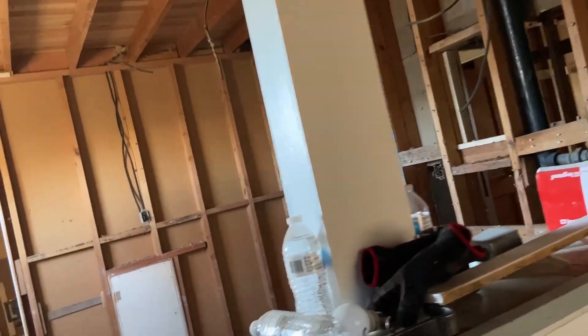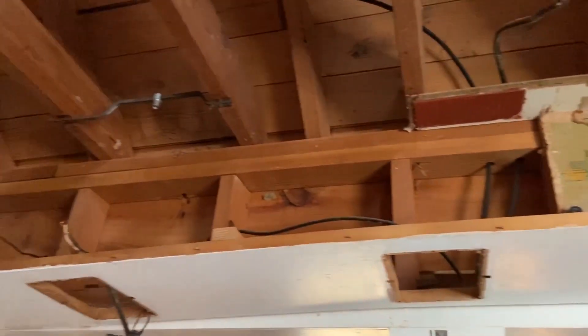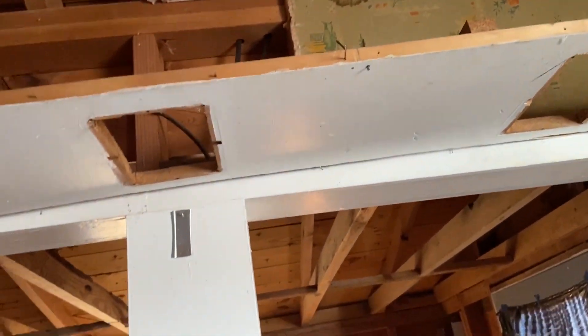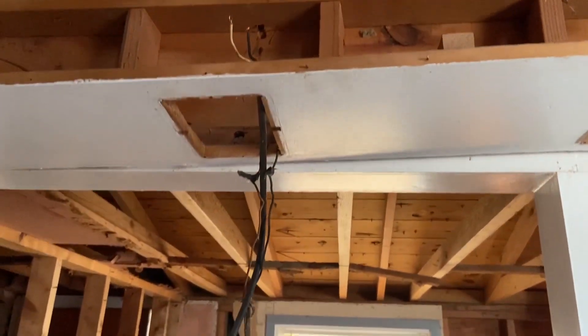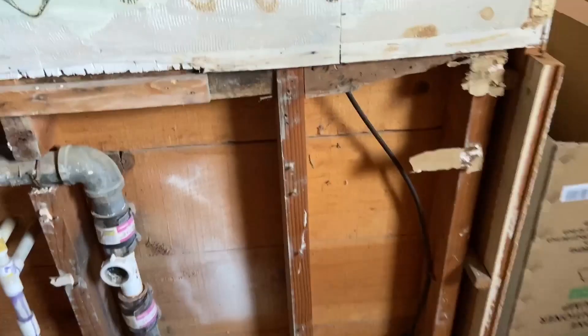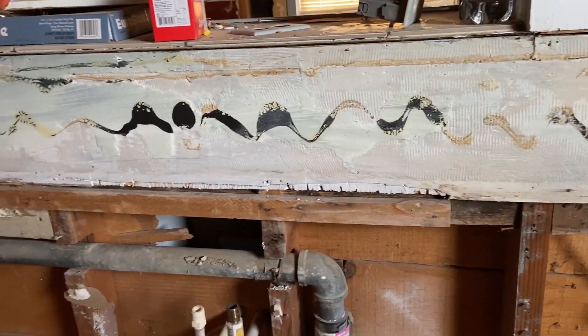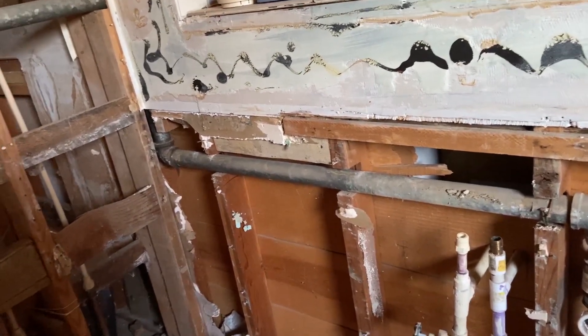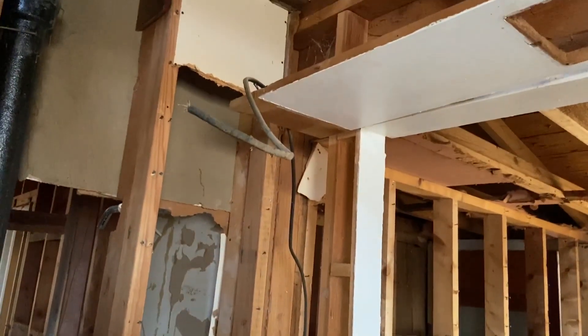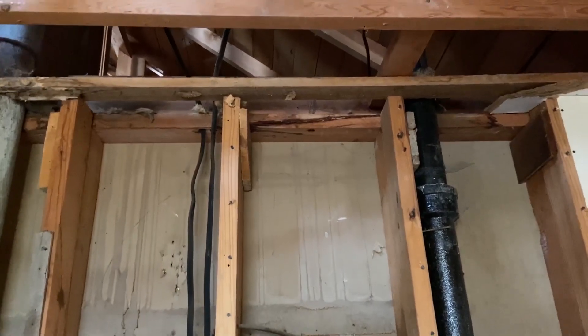This was something somebody built but we kind of liked it. These studs on the other side — they kind of need to stay. You can see up there that some of these are in fact load-bearing. I'm not even sure if it was done properly to open a hole that big. This paneling looks like more of the back of the house. This house was modified so much — I know it was not built all at one time. It looks like we might have some cracking damage there, though that's probably just part of the wood.